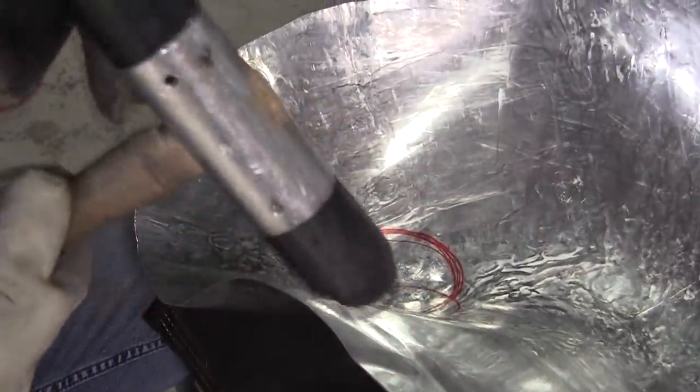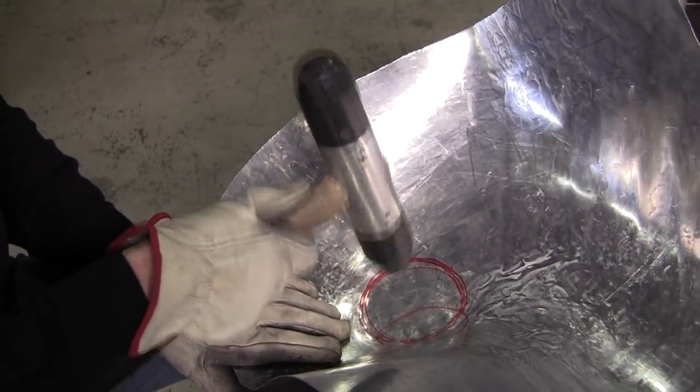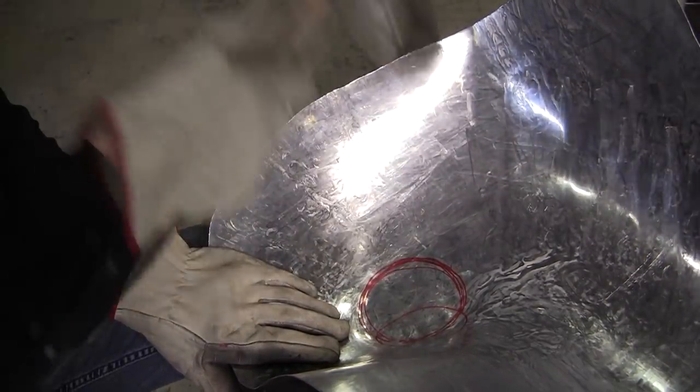If you're using a sharp end of the hammer, you've got to be careful because you can ask the metal to do too much. So when you use the sharp end, it focuses your blow, but you have to hit it much easier and let them accumulate rather than really wailing on it.